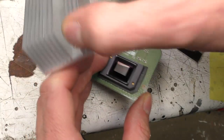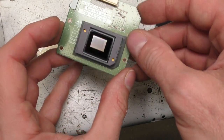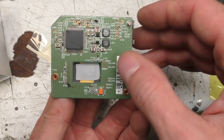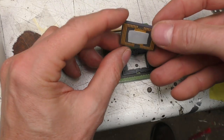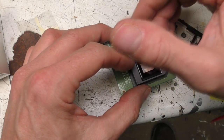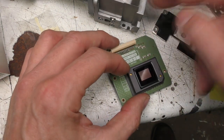This is the actual DLP board, with a fairly big heatsink on the back — not sure how much is from the DLP itself versus energy from the light source, probably a mixture of both. There's a power management chip and a few inductors, as the DLP uses quite a lot of unusual voltages, so there are probably high-voltage drivers on here. Another Texas Instruments chip in an unusual package with short pins interfaces with the optical unit, and the board needs to be held in accurate alignment using alignment pins inside the back of the optical block.